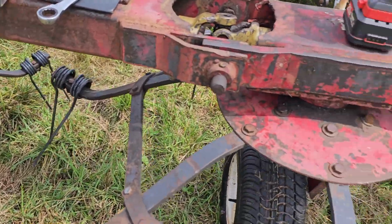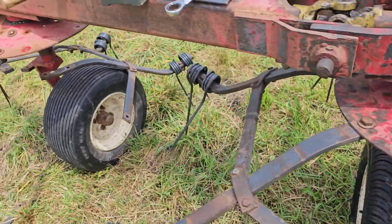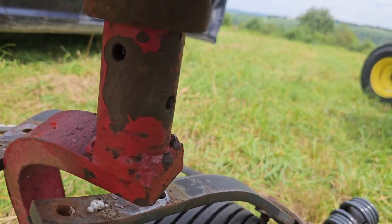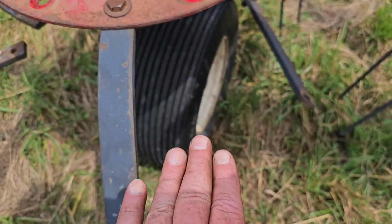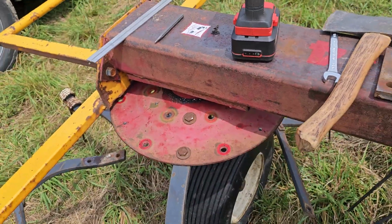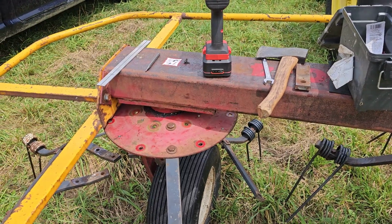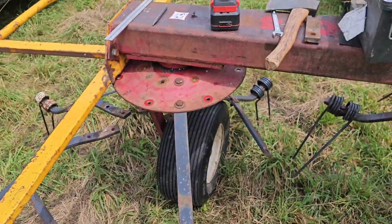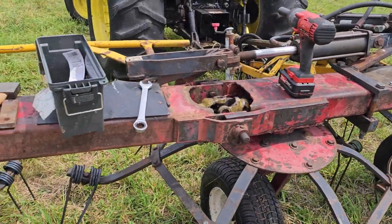And as you can tell how hard it was to hammer on that, needless to say, that one right there was rusted on too, won't come off. Took the roll pins off and it wouldn't come out. So I won't be able to drop that down and rotate it so its gears can come back up in time properly. So plan B, Farmer Jones, I'm just going to drill a bunch of holes and reset the tines and see if I can make this thing run. Not proud of it, but I need to get the hay done.